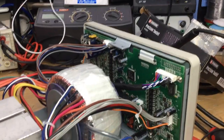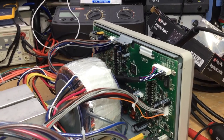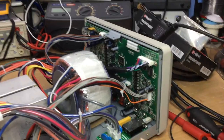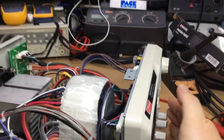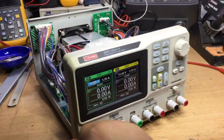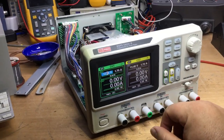I think they supply the microprocessor as well as the front panel with a switch supply, probably part of a buck converter regulator circuit. I could be wrong. Without a diagram, it's difficult to tell. But when it's off load, as in working like this, without the output being switched on, hence those relays to energise the outputs being enabled by pressing this button, it lasts a lot longer.